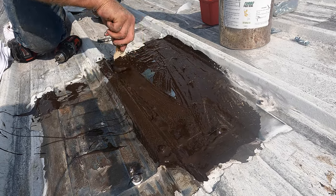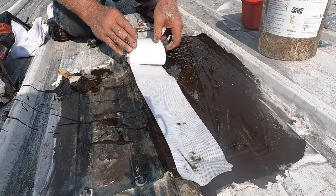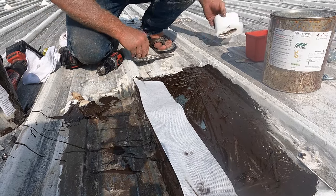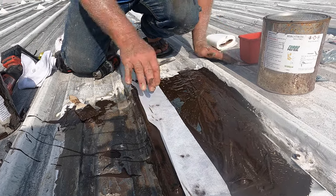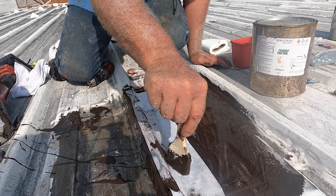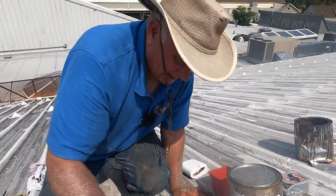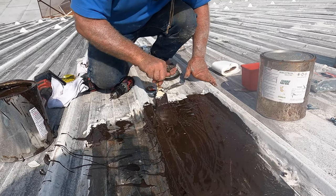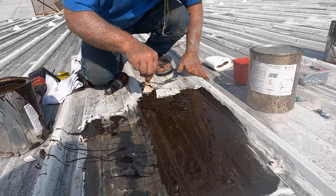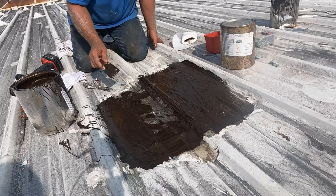For quality, you need to spend time. I'm making a transition between two metal pieces — I can't just put Turbo Poly Seal directly, it would crack over time. To prevent cracking I embed fleece to bridge that metal-to-metal transition. I honestly believe Turbo Poly Seal is the way to go — I've used other sealants before and they don't hold up.